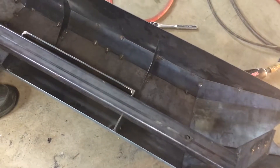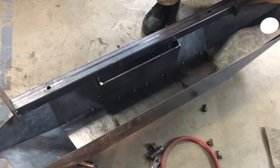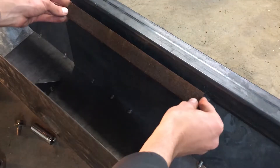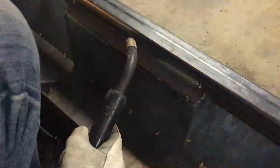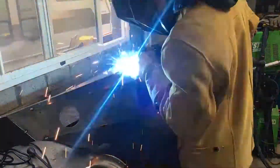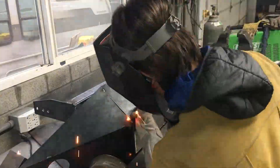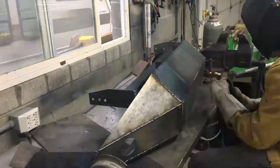You can see a gap was created from when I moved the bumper up a few inches. To add some extra strength, I welded in a piece of flat stock. For the final welds, you can see I am jumping around a lot, and that's because I'm trying to be conscious about the heat and where it's going to avoid warping the bumper too much. I welded full length beads on every joint, inside and out — I want this thing to be strong.